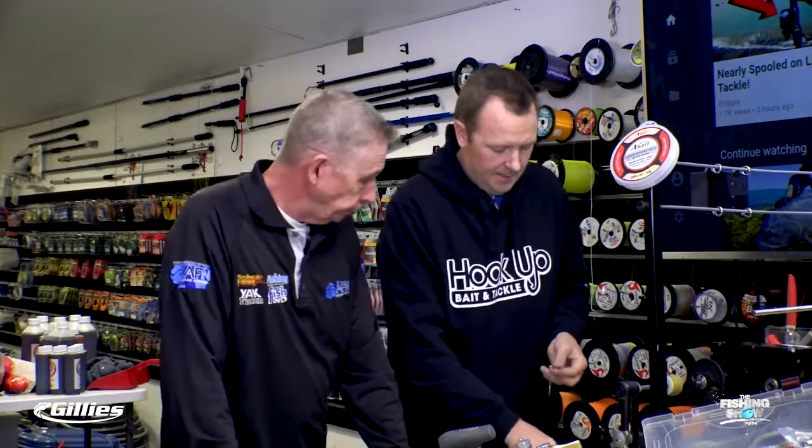All right, and I use the heat shrink with the glue on the inside. Where do you get that? You get it through an electrical marine supply. Yeah, absolutely. The reason I use the stuff with the glue on the inside is, you'll notice when I shrink it, the glue melts, and then it creates a watertight bond there. Gotcha. So you don't have to worry as much about your crimps rusting out.